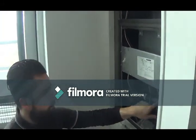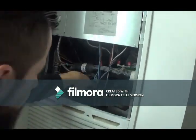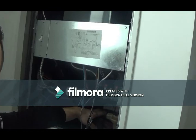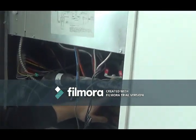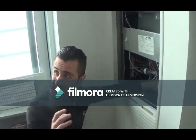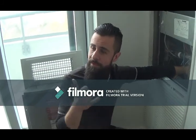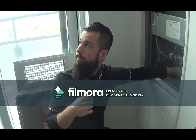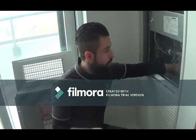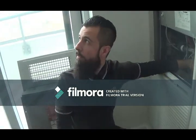If you look down here, you've got your two isolating ball valves, your supply and your return. You've got your three-way motorized valve and your actuator. So on call for heat or cool, I'm not sure if you guys get into these. Do you ever get inside to look at these fan coils when somebody says there's no heat? If someone calls, the first thing you might want to check is the actuator. It's so easy to take off. At this time it's all under warranty, right? For a year, yeah.